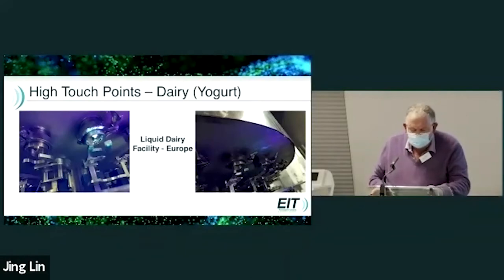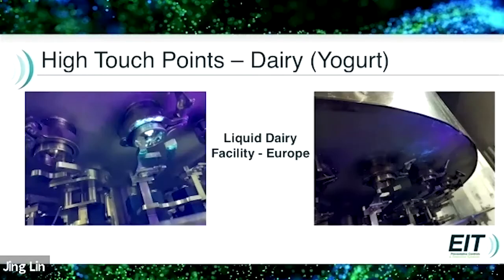In the dairy here, this shows a yogurt filling line with contamination around the filling head. The problem was the yogurt dripping down the side of the head and onto the underside of the hopper, shown in the second picture, and then onto the filling head.